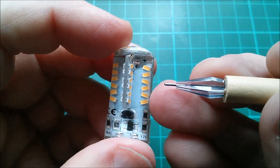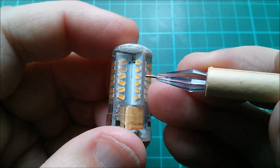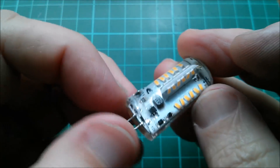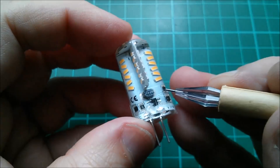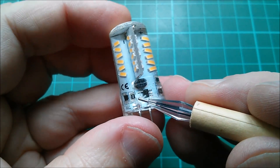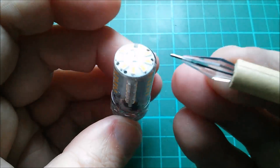We've got lots of LEDs, and they've seen fit to put them at these interesting jaunty angles — someone had fun with their PCB layout software. They're probably in a series string, but they didn't have to lay them out at interesting angles — it does give this a rather nice appearance. There's a 470 microhenry inductor, lots of diodes probably in a bridge configuration, a resistor, and what looks like a SOT-23 five-pin controller chip — presumably an LED driver chip.